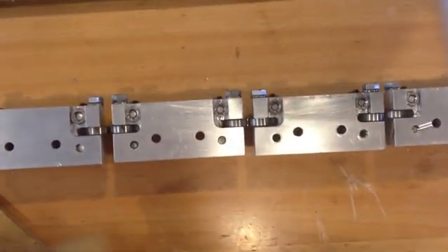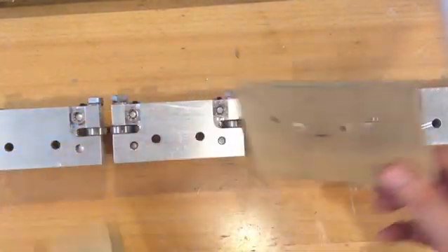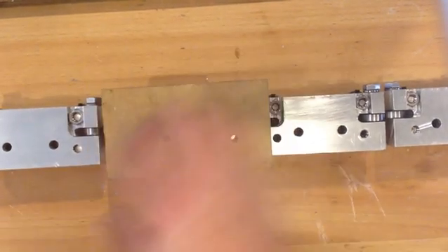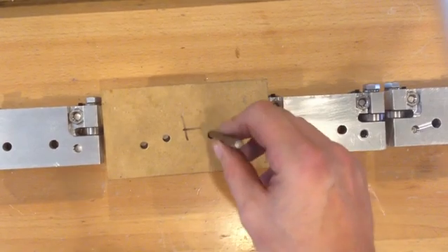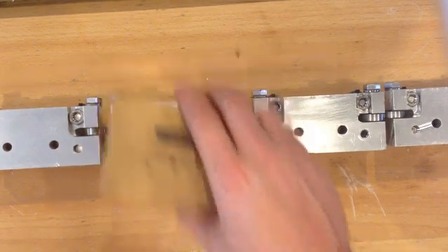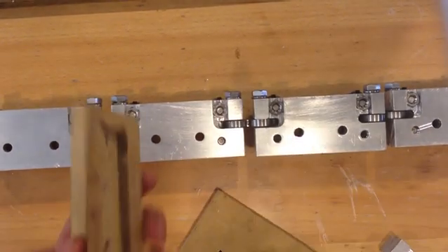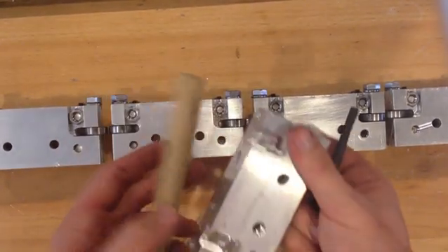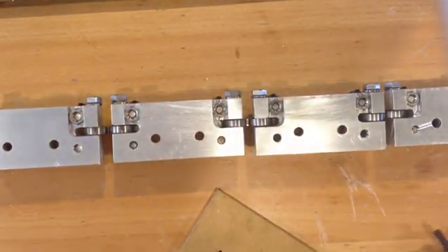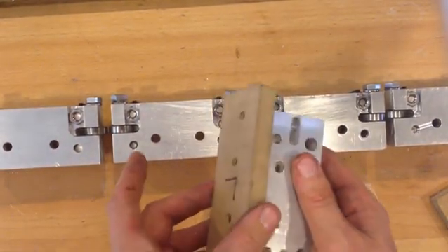What I ended up doing is creating some other jigs for the drill press. Basically, this is the top one — it's pocketed out, it just slips on top of the bar. All these holes are a quarter inch, and this is a quarter-inch transfer punch. I would just sit it in there and tap it, and that would give me a divot, then I would later go in and drill out the hole. Then I'd flip it on its side and do the other one. This is the left side that has the set screw one — again, all quarter-inch holes. This is the left side, and the other one was the right side.